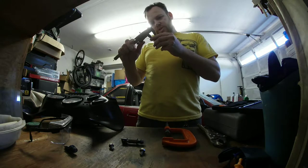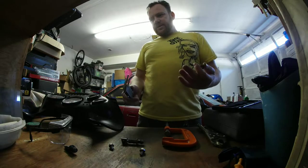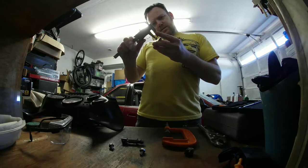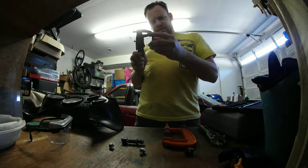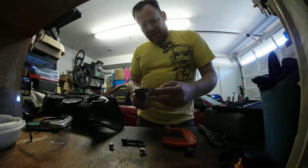Okay, looks like we're at 13 millimeters. That'll certainly allow us to just divide that in half, so 6.5 millimeters. So I need to take 6.5 millimeters out of this. If I take 6.5 millimeters out of this, it's not going to leave a lot for the threads